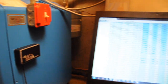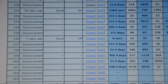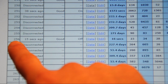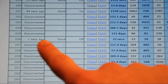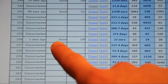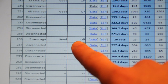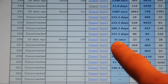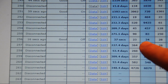Now if we check our server where we have all of our sensors, you can see that for this particular one, the serial number is 256. Its last communication with the server was 15 seconds ago. The radio communication state is currently good for the Wi-Fi. The boiler is right now off, meaning that the flame is not on. The last cycle was 31 seconds ago, and during that cycle the boiler was on for 23 seconds and off for 34 seconds.